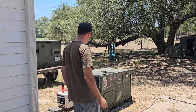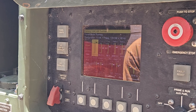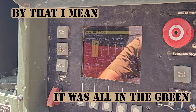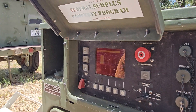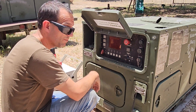Five minutes past the halfway point, running at about 218 degrees. Everything is doing what it's supposed to. It seems like it's running a little hot, but it's now 93 degrees ambient and it's sitting right in the sun. We're running it about 20 percent over rated capacity, so that's expected.